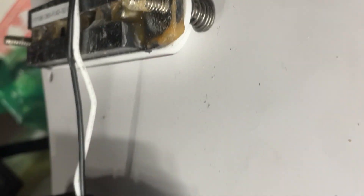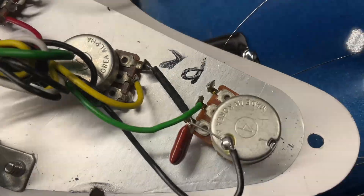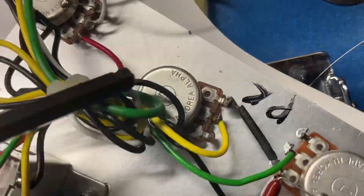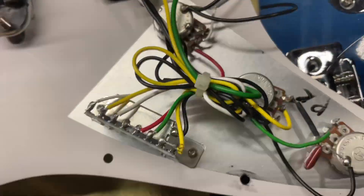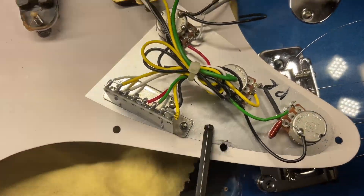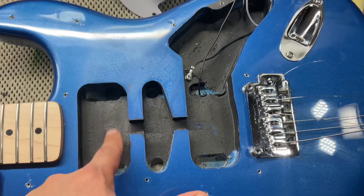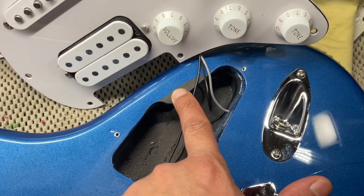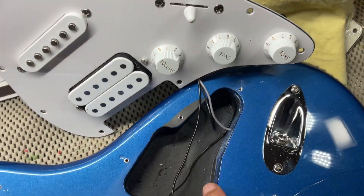Just from the side, they're using the spring instead of those grommets — the orange ones. Here's your PCB board for your five-way switch. Here's your Alpha 250K second tone pot. Here's the first tone pot here, and then your volume. I like how they put the shielding here. The body is painted in here with some kind of shielding. Here's your grounds, and then there's another grounding here that goes to your pickguard — I'm assuming that's where the shielding is for the pickguard as well.